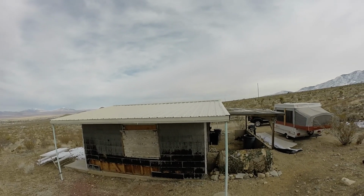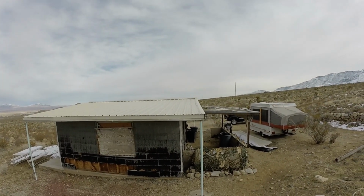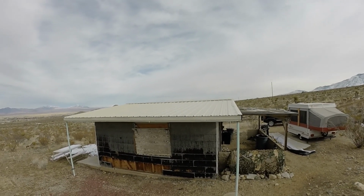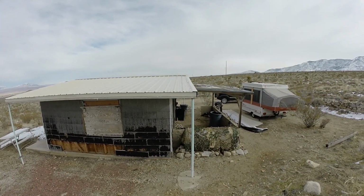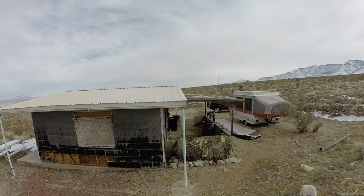And yeah, you're gonna need some screws. I got by with 500 of the main screws, and I believe 500 of the stitch screws, which are smaller. The stitch screws are what you use along the ribs. You'll see along the ribs where they overlap, those are stitch screws on top. They're a little bit shorter than the standard ones.